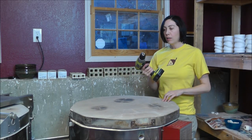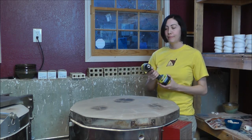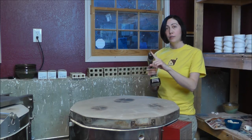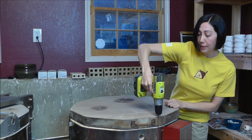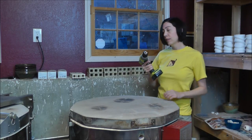With my holes already marked on the lid, I'm going to use this little electric drill. One thing to be sure of: use the right size bit — 3/16 inch for me — but make sure it's long enough to actually go through the entire width of your lid. That's one thing to look out for.